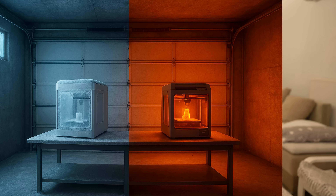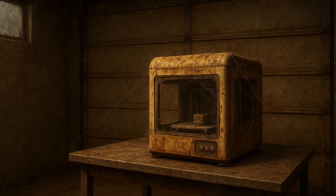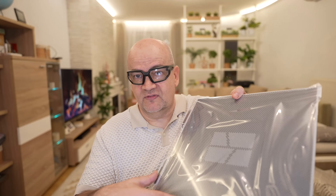Another case: say you're using the printer in a garage, where temperatures range from 14°C in winter to above 30°C in summer. We have thermal dilatation of the printer structure, and we can use the vision encoder to compensate in X and Y. Of course, the question is also what is the temperature dilatation of the vision encoder itself. A third case: after 10 years of use, the belt wears and elongates unevenly, causing bigger errors on certain areas of the surface. The vision encoder can improve accuracy along X and Y across the whole surface.